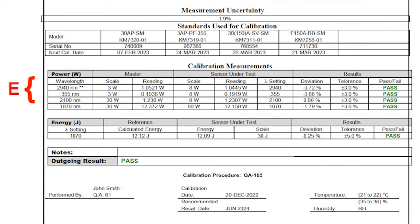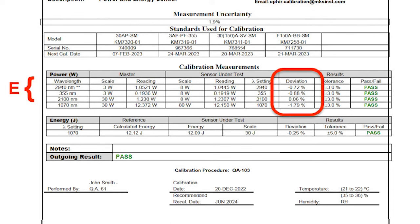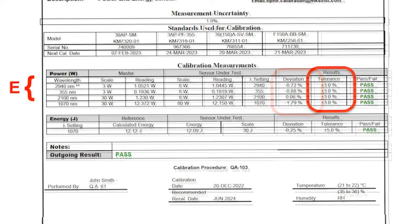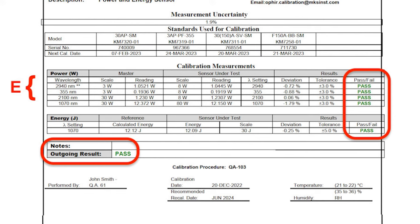Region E: The results table holds all of the relevant measurement parameters and results. In all COCs, there will always be a results column which includes the raw data reading of the reference sensor and of the device being calibrated, the deviation in percent — which tells us by how much the device deviates from the reference — and the tolerance of the measurements in percent. Tolerance here is the maximum allowed deviation; this shows up as measurement accuracy or similar in the sensor's data sheet. There is also a pass-fail statement, which is based on the decision rule used — a statistical criterion for deciding pass-fail given the stated tolerance and the measured deviation. Details of the decision criterion are given in region H.